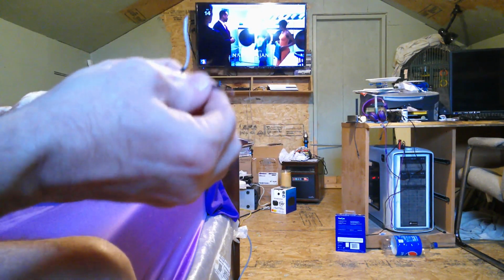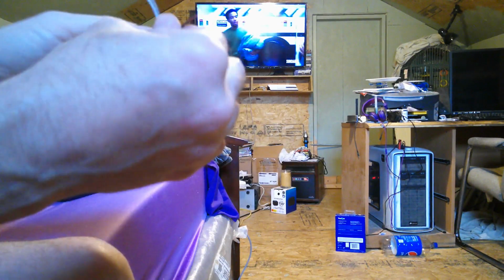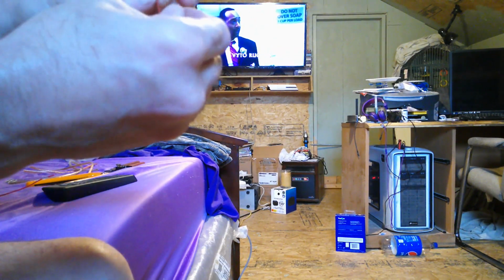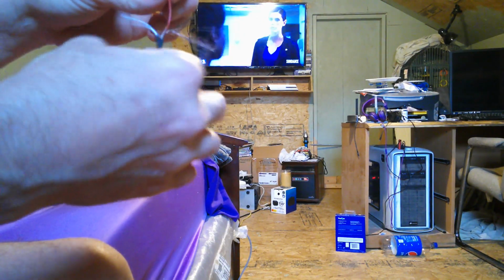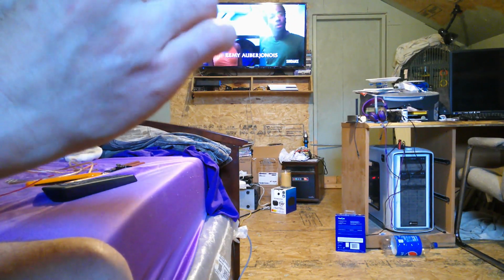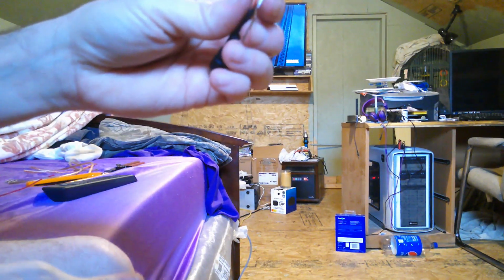Right there, I heard it. Gently, I'm not pulling hard, because if you pull hard, you're going to break the wires. Which, alright, I think I broke one wire. Yeah, one of these solid gray wires here. Then what I'm going to do is make sure no wires are sticking out. Alright, you're good. I'm going to take these two and twist them together. That's going to be one wire.